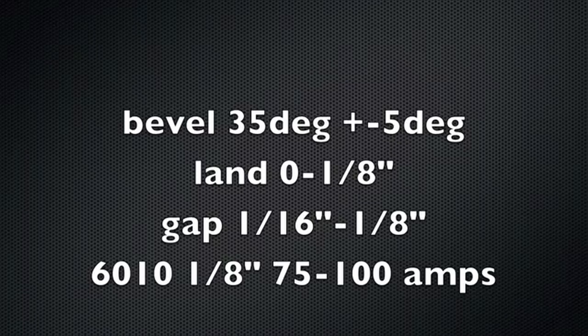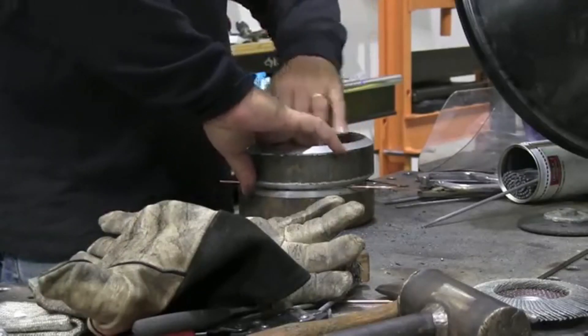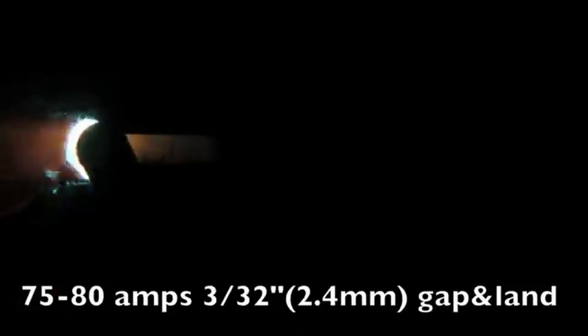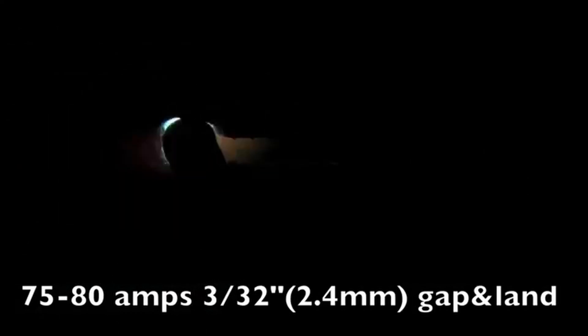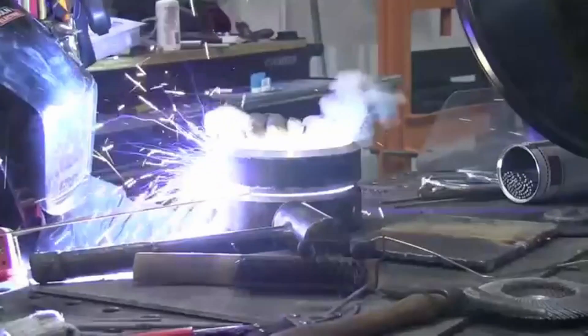16th to an eighth — might need closer to 70 amps. If they're going by the specs in the UA PDF, it says adjust your amps accordingly where you can use at least 75 amps with no problem. This is the time to kind of gauge that when you're putting a tack somewhere.